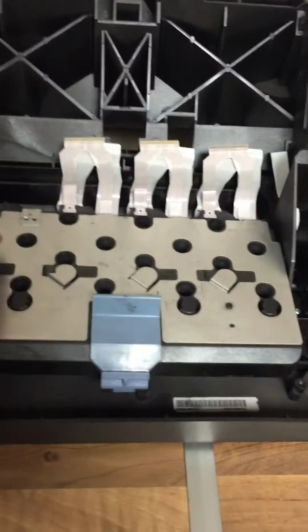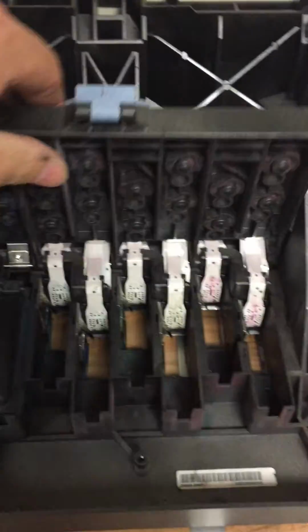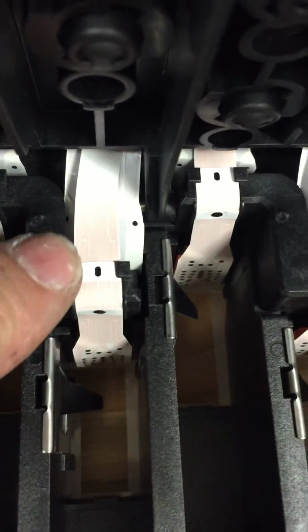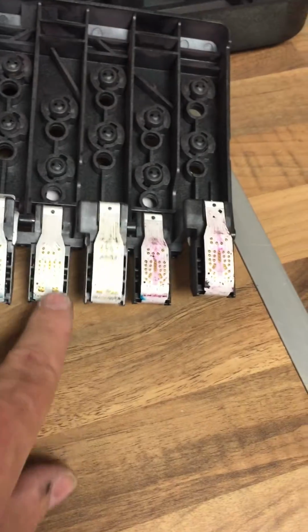The flex cable, obviously on your one, there's a row of little screws at the top, and then the flex cable comes out, and that's the whole of the flex cable. Obviously this is a second-hand one. On a new one, all the connections are brand new and clean, and the black dots are all lining up with the two little brackets which I was referring to. So a little housekeeping tip is to clean all these connections down so it is as clean as that.